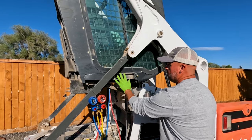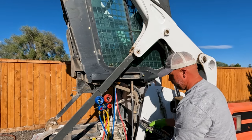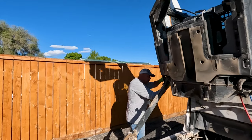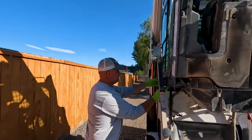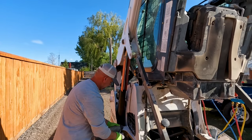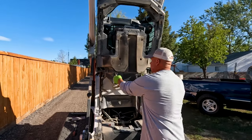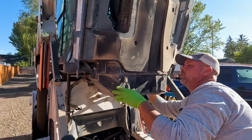You can see they all have this little cover on the side, and this is the plenum — this is the intake into the AC system. So I'm going to pull the filter out on both sides. And then what I'm going to do is take off my cover to get access to the coils.